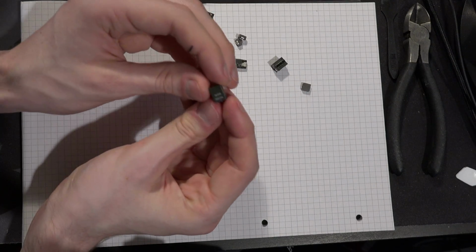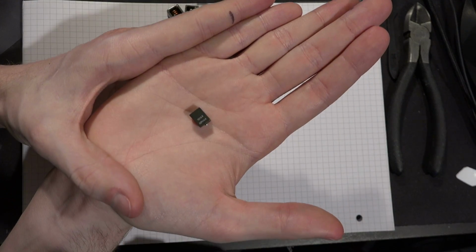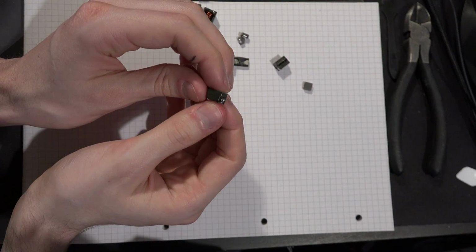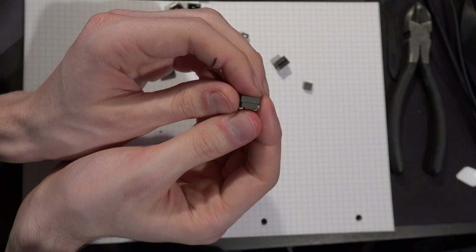If you had an R9 290X, these should be pretty recognizable. Gigabyte used them on a few motherboards. Those coil whine as well. So this style of inductor is very liable to coil whine, and most of that's down to the way these are constructed. So you can see that line over there.